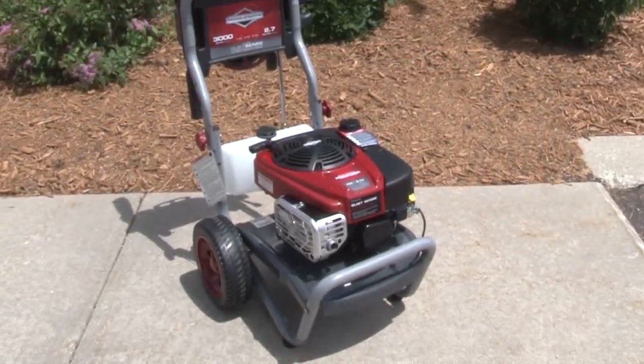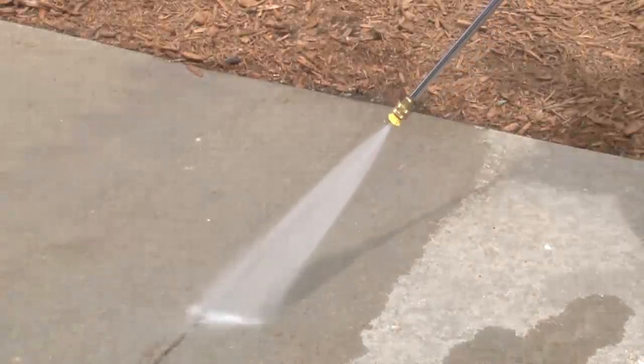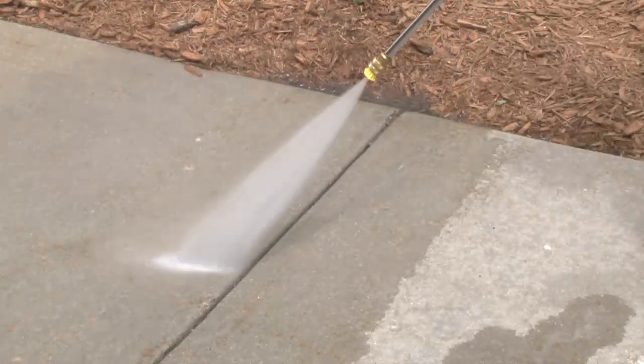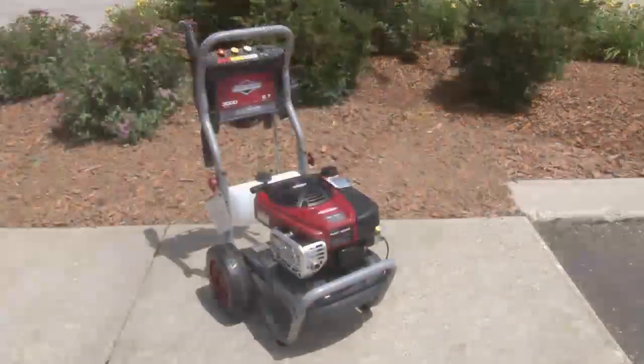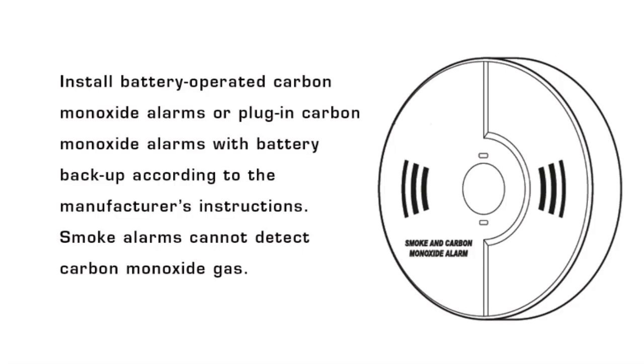Although powerful and safe when used correctly, running engines give off carbon monoxide, an odorless, colorless, poisonous gas. Breathing it in could result in death, serious injury, nausea, or fainting. So it's very important to operate outdoors and never inside of a building or enclosure, even if windows and doors are open. Keep at least five feet of clearance on all sides, including overhead. Make sure you have installed battery-operated carbon monoxide alarms inside your home and that they are all in proper working order.